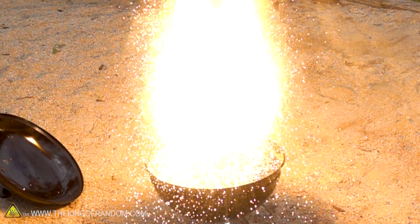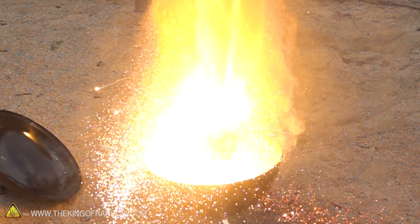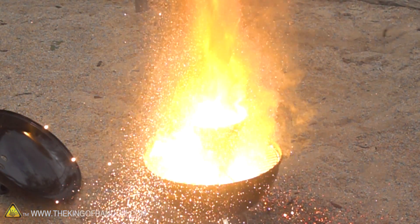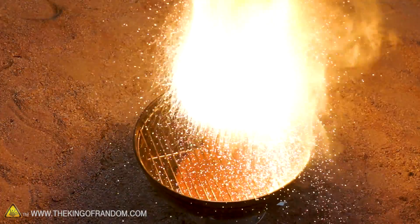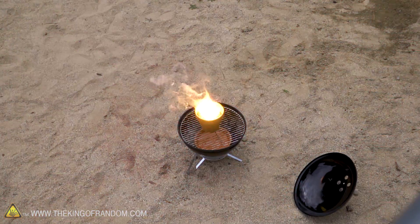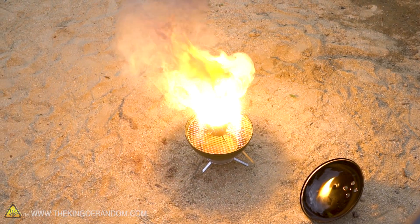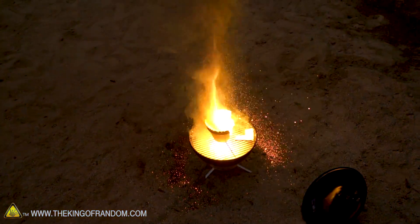Back to the barbecue — let's take a look at the slow-mo replay. It looks like I caught the slow-mo just as the reaction was really starting to take off, and you can see it's glowing as bright as the sun, which makes it very hard to see what's happening. The iron oxide is reacting with the aluminum to produce a lot of heat, putting off a lot of light energy. What you can't see happening inside is all that molten metal flowing down through the bottom hole, cutting through the grate, and landing in that terracotta dish underneath. I have to say that's probably the most dramatic way I've ever started a barbecue. Kind of looks like peering into a volcano — nothing but glowing molten lava. That is fantastic, and probably the coolest way to cook food, honestly.